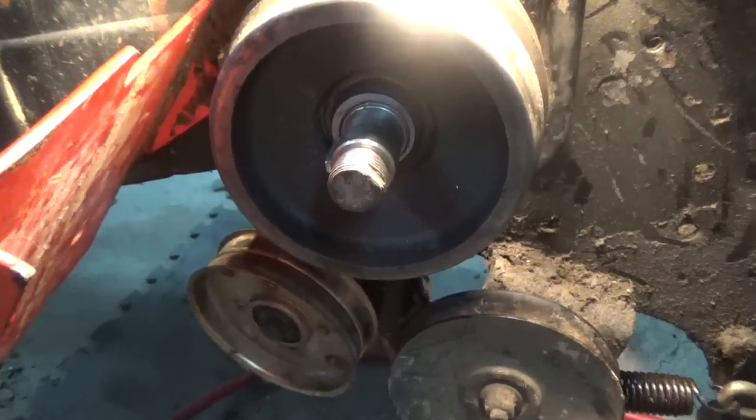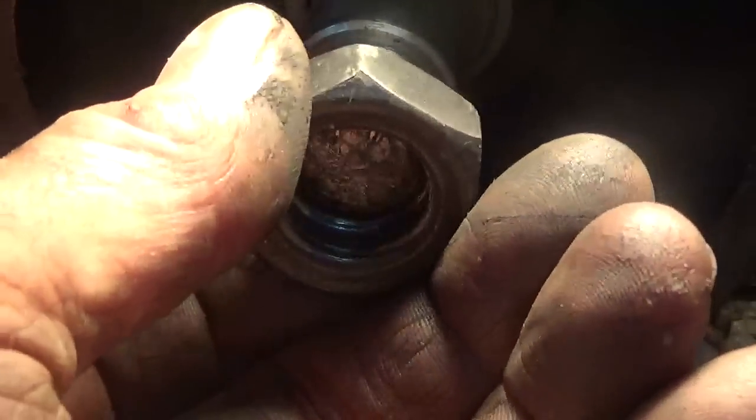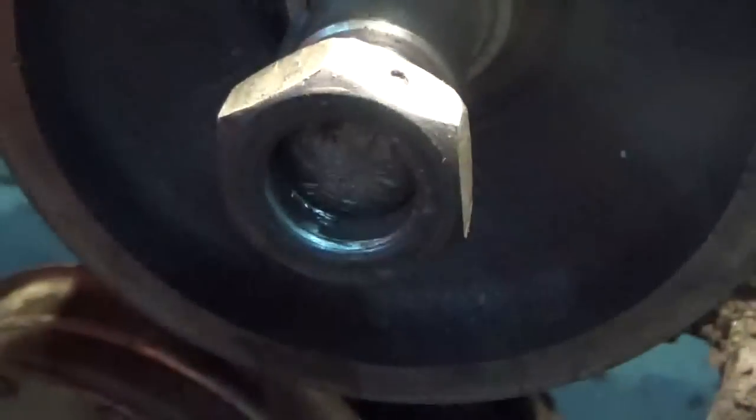Okay guys, I don't know if you can see this, but I'll show you one of my mistakes. If you look on the edge of this shaft, I had to take my grinder and grind this off. When I was bumping on something trying to get this shaft out of here, I hit the edge of these bolts, or these threads, and I goofed them up pretty badly. They were at the point where I couldn't get the nuts started. I mean, they were really bad. So you can see I got the nuts started there, and it'll go on. Sometimes when you mess stuff like that up, a grinder is nice, you could just cut the threads out. And that's all I did. I just touched the top of that with the grinder to get the damaged threads out of there so that I had a way of getting back onto that. It happens, but at least there's a way to fix it.